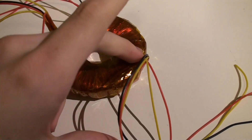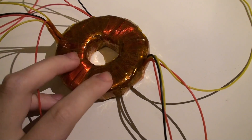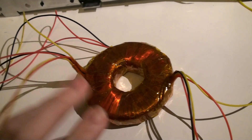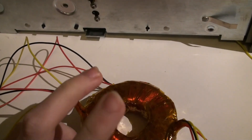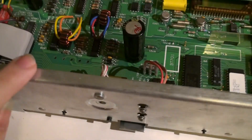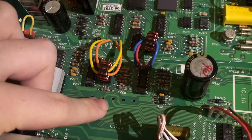I kind of missed a few details when making this transformer. I started out by winding on all the mains wiring on the inner layers, which is typical for how you build a transformer. Then I practically redesigned the same transformer as the original, except toroidal instead of an E-core — but I forgot one thing: it's going to have a heck of a lot of common mode noise.